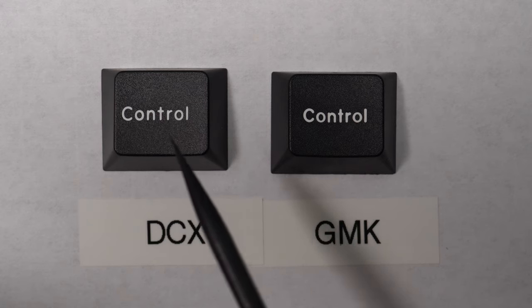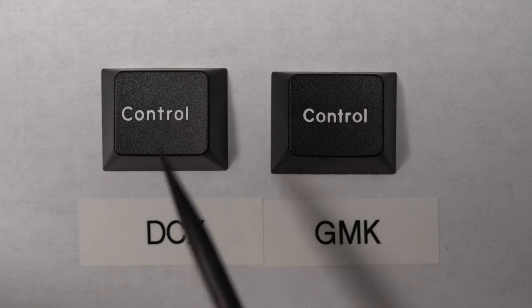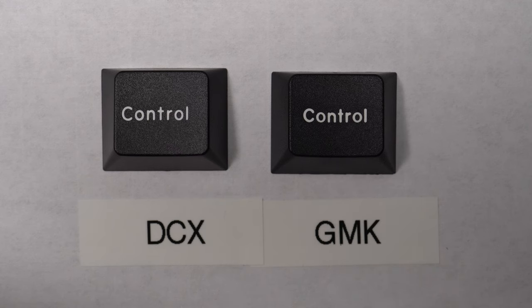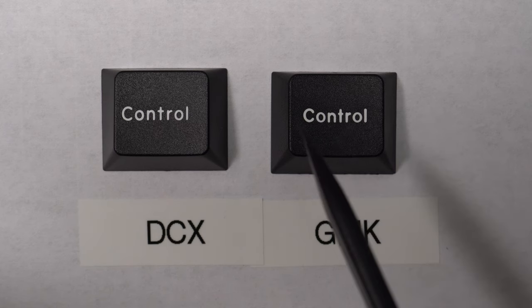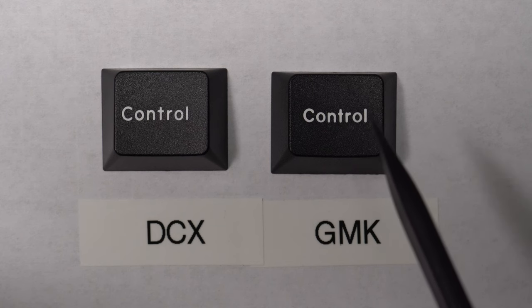This is what they had designed, which is what leads me to believe that it's a minimum thickness thing, that they got a spec from their manufacturing partner that you can't have any sections of color smaller than a certain size. And GMK almost certainly has the same issue, though their minimum wall thickness does seem to be lower. It's hard to tell how much of that is mold bleed.